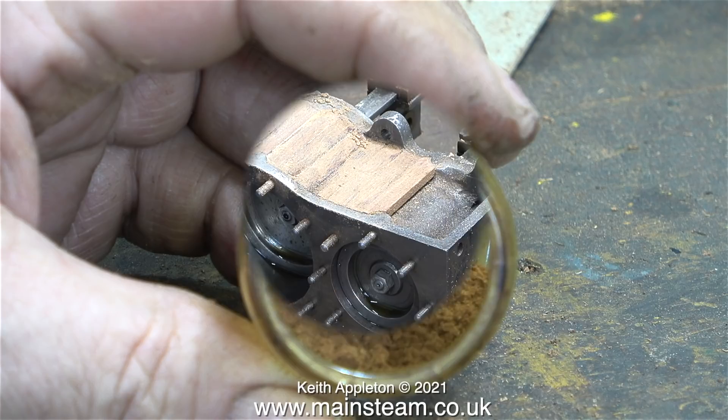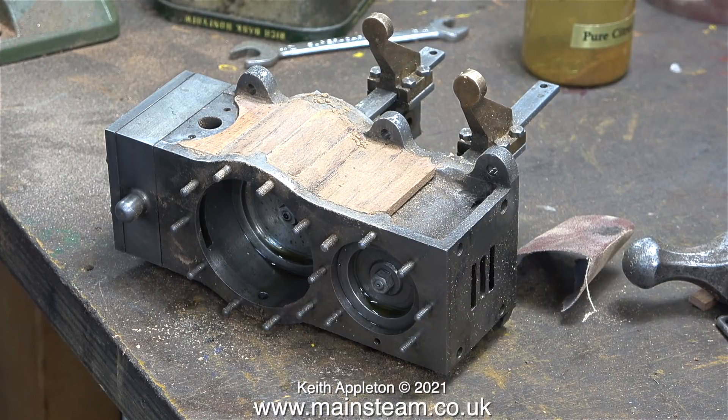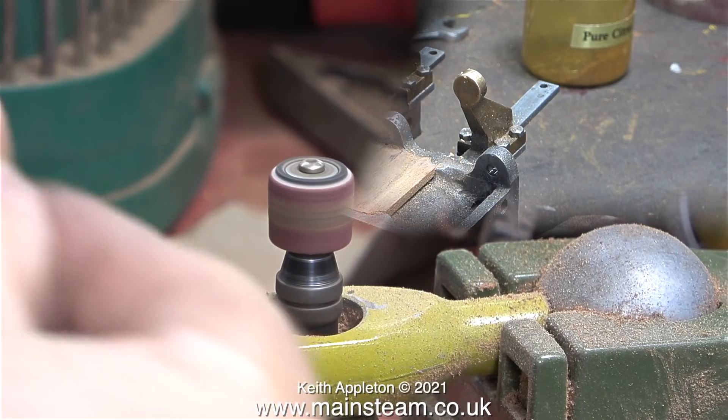This clip actually shows me doing the job. I apply some cyanoacrylate adhesive to the joint, then wipe off the cyano and tip in some mahogany dust like this. This effectively fills any gaps.